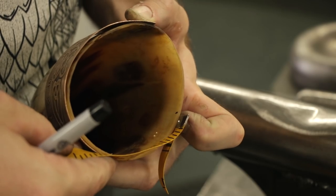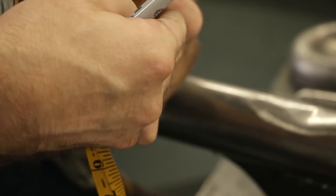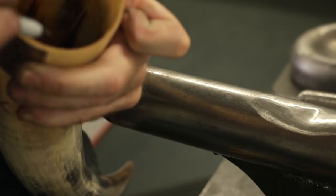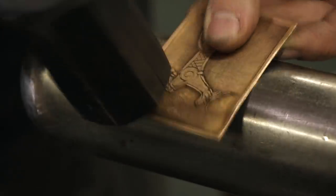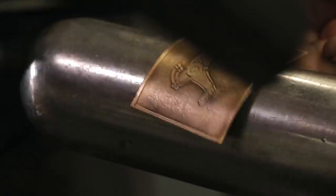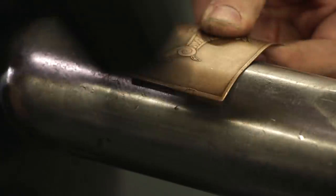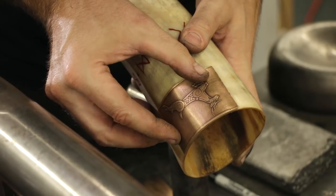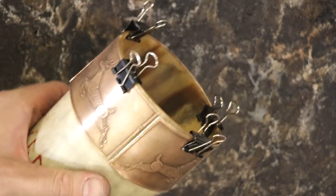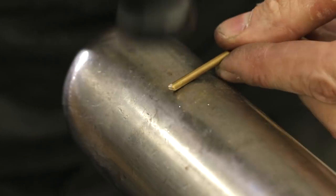Because I'm going to bridge the gaps between these pieces — there are three pieces going on the rim — I'm going to bridge them with a piece of metal to hide the seam. I'm just going to keep bending my metal until I'm happy with how it's going to sit on the horn. Then we're going to start riveting our pieces on from the center out, top down, because we want to make sure it's nicely on the top edge. We don't want to put in any of the corner rivets because we're going to bridge those with another piece of metal.